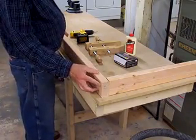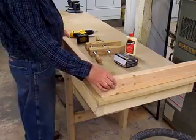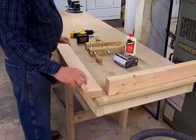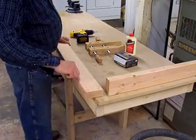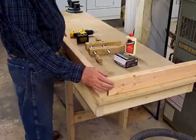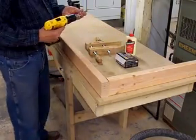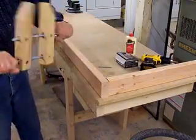We may or may not need to drill pilot holes depending on how hard this is. I noticed when I was drilling it wanted to lead off sometimes. Part of that was the possibly dull drill bit, as well as sometimes the grain in the wood has hard spots in these dark areas and causes the bit to move one way or the other. So it may be harder than what it looks like, but I'm going to try a screw without glue first just to see if it will take it. If not, I'm going to drill some pilot holes.